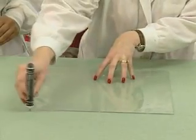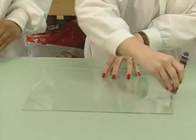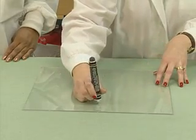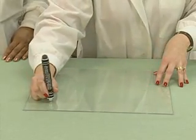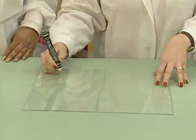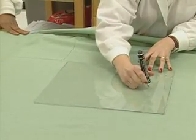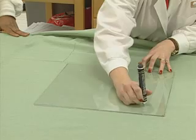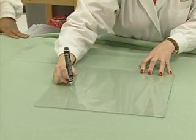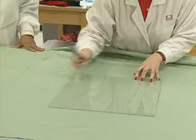Mark each specimen with three sets of length benchmarks and three sets of width benchmarks using a ruler, a stamp, or other suitable device. Make sure the ink used is indelible to laundering. Normally, 10-inch benchmarks are used as they make the mathematics easier to calculate. Some tests call for larger benchmarks, which require the specimen to be larger than 15 inches square.